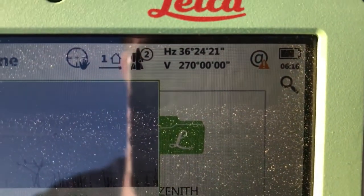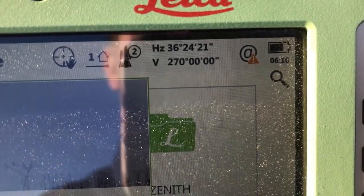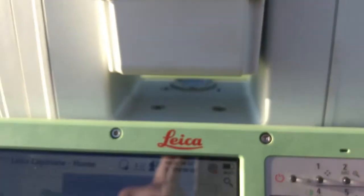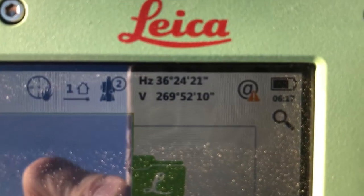One quick thing: in Face 2, if the zenith angle is 270 degrees we're looking horizontal; less than 270 means looking down; greater than 270 means looking up. Looking through again, the horizon does not rise to meet the horizontal crosshairs when we're level. If we look down to the horizon, this is how you get the Al-Biruni method of measuring Earth's radius by measuring zenith angles to the horizon.